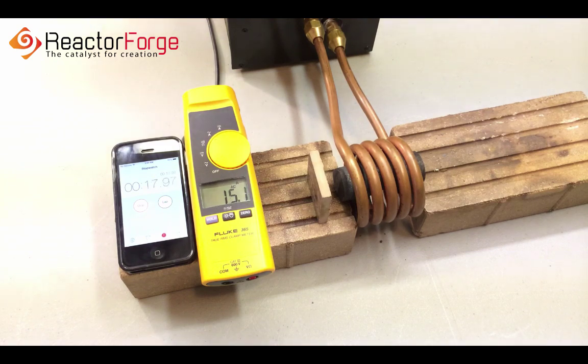I'm using a 5 turn coil here to evenly span the entire 3 inch section. Now if we used a coil with fewer turns, it would draw more current and heat up quicker, but it would be at more uneven heat — you'd have to move the bar around. What we're going for here is a completely hands-free heating of this section of bar stock.